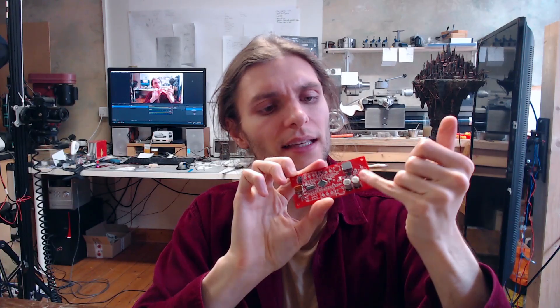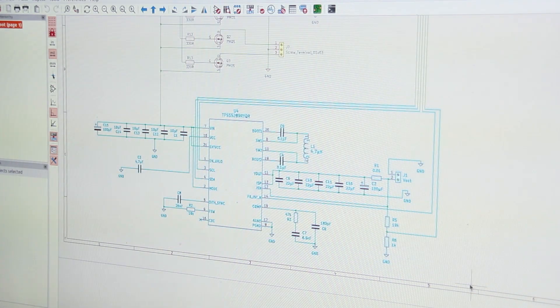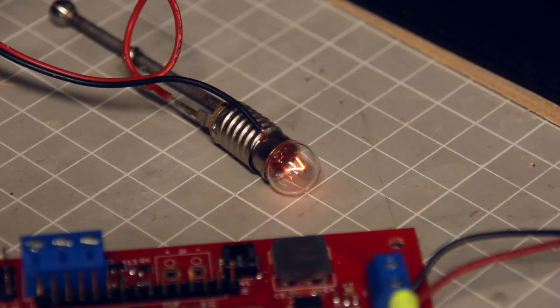Lastly there's this section here which gave me the most headache because it's analog circuitry, which is quite challenging to design — and that's a digitally controlled buck-boost converter. It's quite a mouthful, but what it does basically is turn the 5-volt input from the USB into any output voltage between 0 and 18 volts.